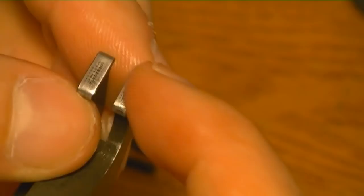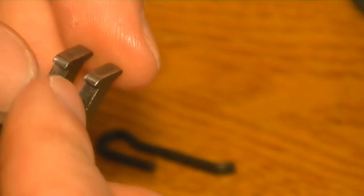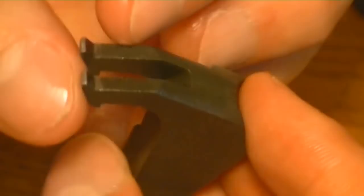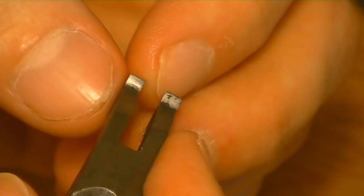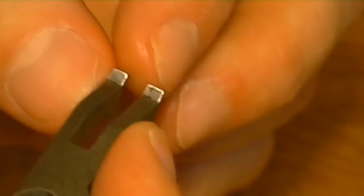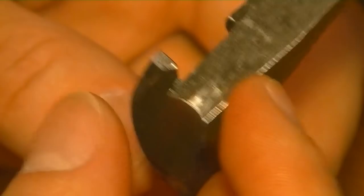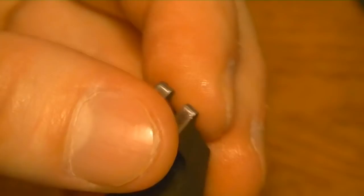Then this — same thing. This isn't really required, but I went ahead and did it. Same as the other one: 600 grit and then 1500. The important stuff on these are the rounded edges here on the sides, on both ends, and here. But most importantly, these back surfaces that are really hard to get to. You might need to use a straight edge or a small piece of wood to get the sandpaper in there just right. Those back surfaces — you probably won't be able to see it, but back here — those are the important ones to get on the hammer. The rest I just went ahead and polished to smooth out the whole action.